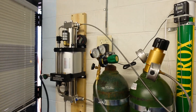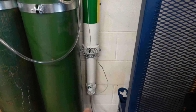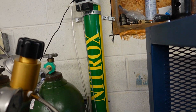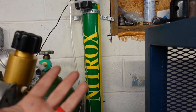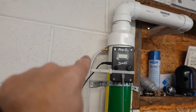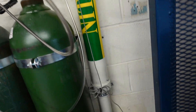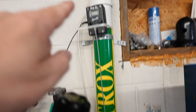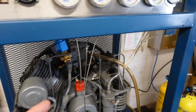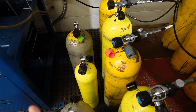Now let's jump over to the O2 system. The nitrox stick — since air is already coming through it going straight into the compressor, basically all a nitrox stick is is agitators inside. Some people put baffles in them; we actually use wiffle balls to agitate the air. So as we turn the compressor on, air comes down through the stick and then we pump in oxygen with this hose right here, mixing inside the stick. It goes through a sensor at the bottom which we read through an analyzer. That pre-blended nitrox gets pumped straight into the compressor system, dried, filtered, and compressed, and then it can either go into a cascade bottle or straight into your bottle.